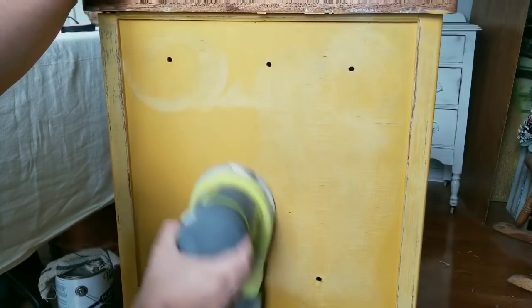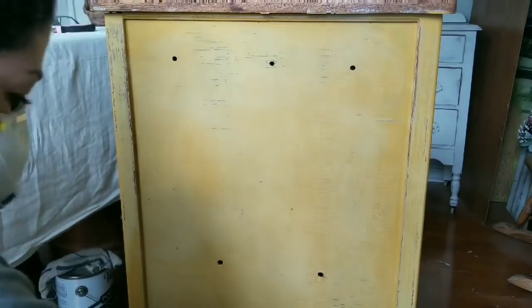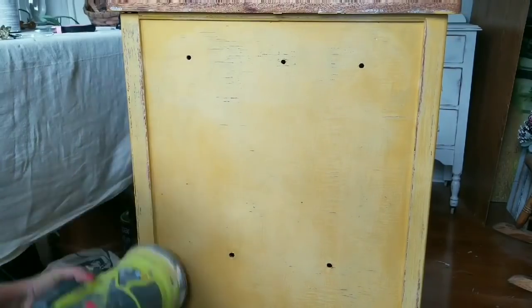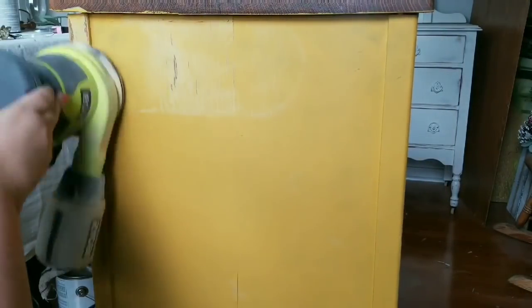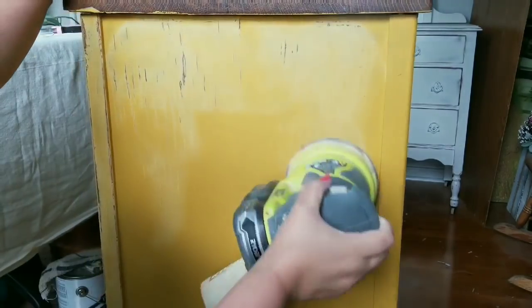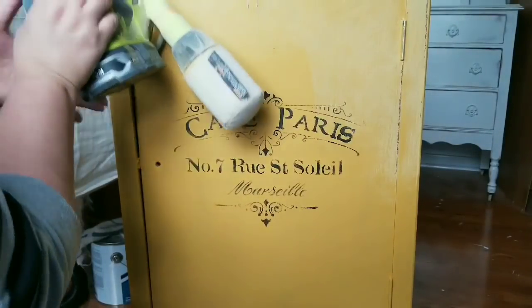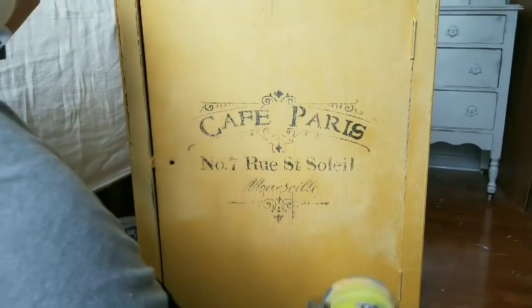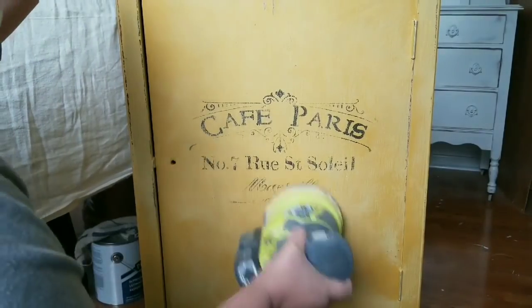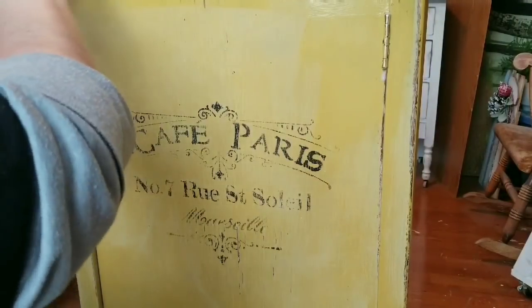On to distressing — I am distressing with a 220 grit sandpaper and the palm sander. This is the part where I love chalk paint: it distresses beautifully. It could have definitely stayed as is, but if you've followed me for a while, you know I really love the distressed style. If it's not for you, you can certainly leave the furniture as is. Just look how beautiful it's distressing — it looks like it has been old and weathered for a long time. I even distressed over the stencil, so it just reads as a very old vintage cabinet. The cabinet had a surface that was very textured, which did help with the distressing.